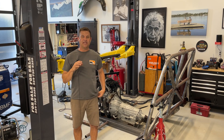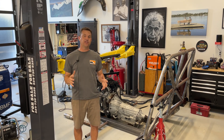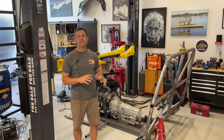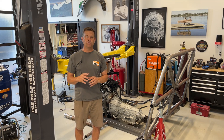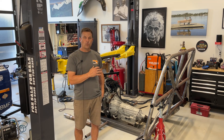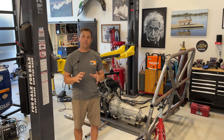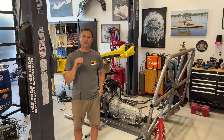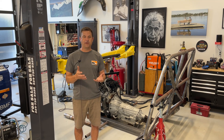So far so good. It's really about taking care of these little tasks along the way - getting the engine mounts in, getting the plumbing done. It's just easier at this phase of the build. The chassis is going to go together perfectly with all those tubes we cut from Bentec, and they've already been fitting together perfectly. Next we're going to continue getting the roll cage together and start working on the front suspension - those upper and lower A-arms and a really complex steering system I'm going to build for about 30 bucks. I hope you'll join us for those episodes, and it always helps us out when you give us a like or a comment. Can't wait to see you next week - take care of yourself.